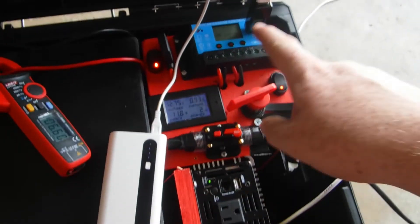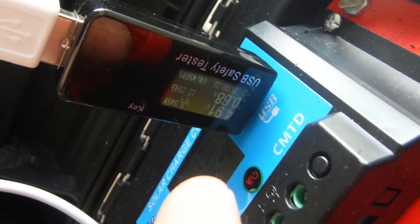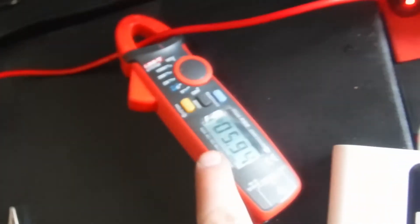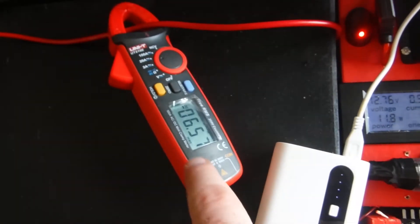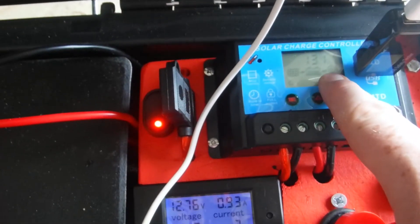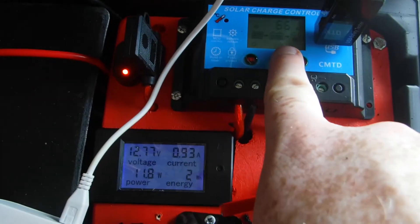Here's what I'm testing. I got a 10,000 milliamp battery backup that I wore down halfway. I'm testing the USB port of the solar charger — we're running almost 5 volts at 0.7 amps. Right here it states that I have about 6.5 amps coming in from the solar panels. Right here I've got 13.1 volts going into the batteries, and this is 7.3 amps — so close.